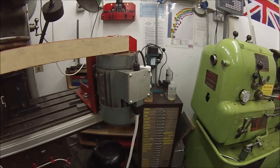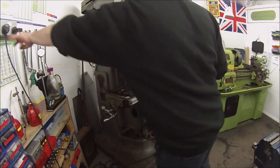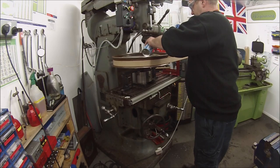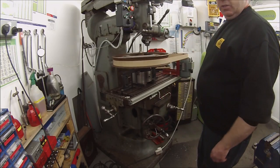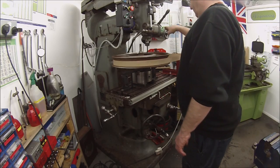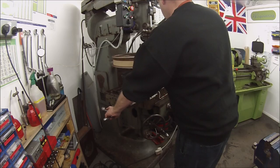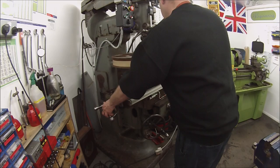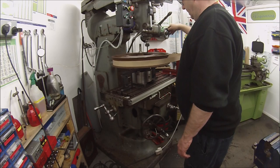Cover is back on the motor terminal box. We'll put our power on and give it a little hand there to start it up. Obviously with this you've got rotating machinery and it's not a very good rim - there's a lot of flaky chrome on it, so keep clear. We're taking the cutter down, putting the feed on by moving the table, just touched, and then just put a couple more thou on - initially I'll just take the rust off.